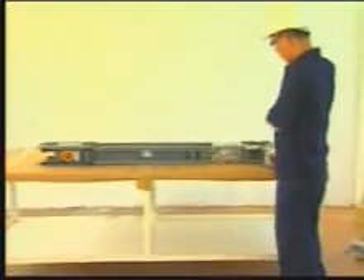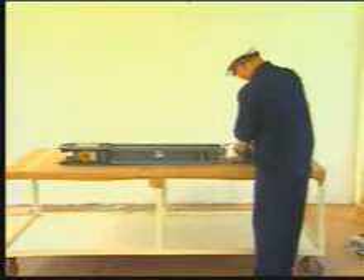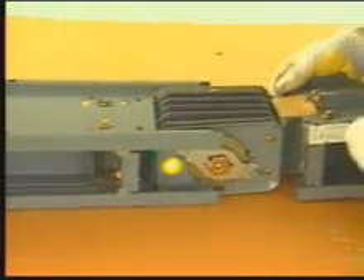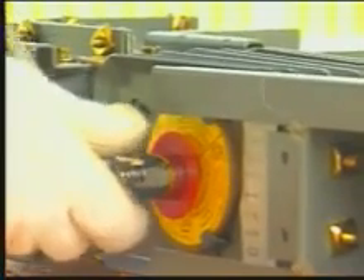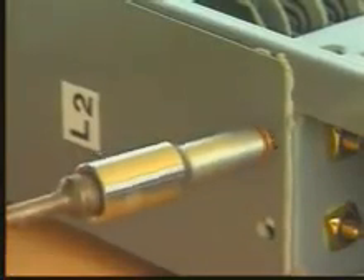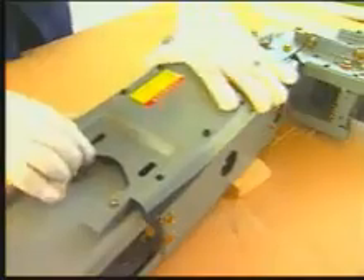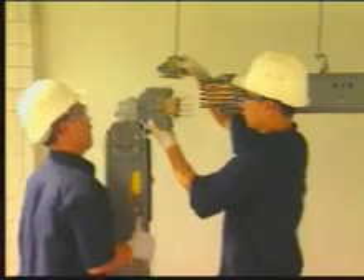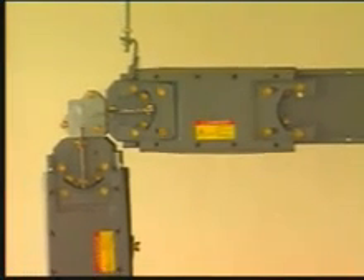If there is an elbow needed for installation, you can pre-assemble some parts. Before joining the sub-assembly, use the megger to check the installation integrity of each phase. Slide the busways together and tighten the vise-tite bolt. Then put the protective cover on after removing the protective cover from the sealants on the center edge of the duct side. Tighten the bolts, then put the tie channels on and tighten the tie channel bolts. Lift the completed pre-assembled section into position, slide it into the previous piece, then install the protective cover and tie channel.